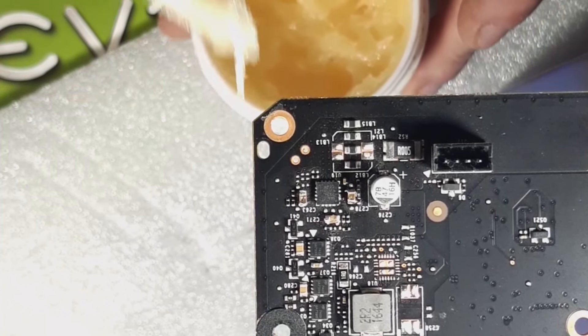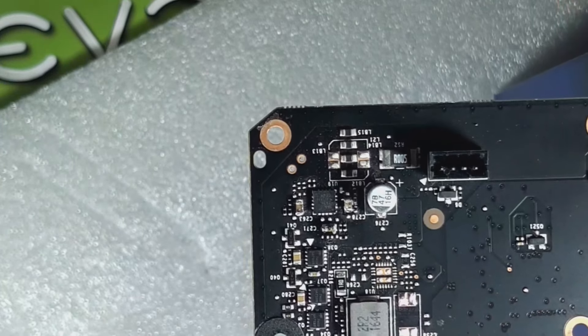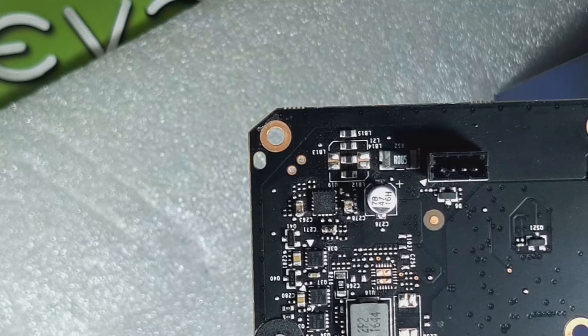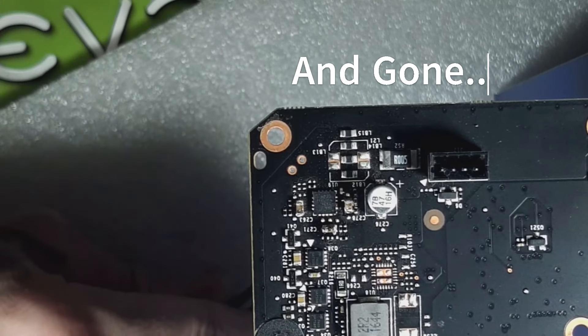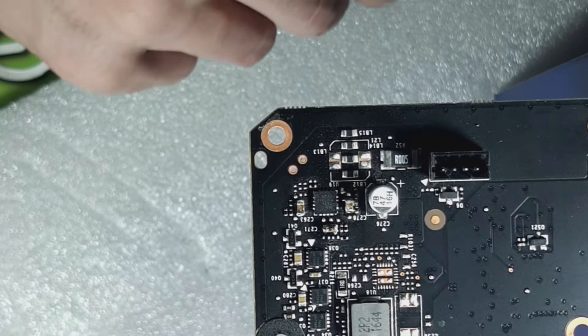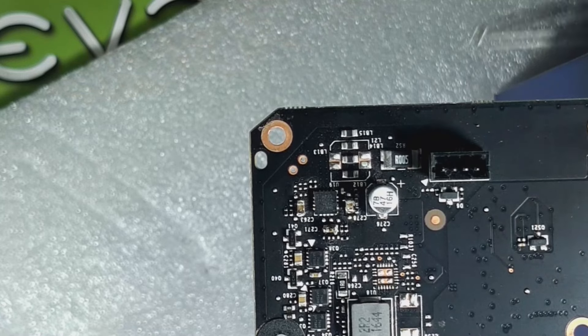Okay, let's get to soldering these. Not bad actually — because I left solder on the pads I didn't need to add much. The solder already in place on the shunt made it fairly quick. The temperature I'm using is 480°C — cranked as high as I can go. If you have a 100-watt iron, let it warm up for five to seven minutes so it's fully heated through, ensuring the solder solidifies quickly without transferring too much heat to the board.